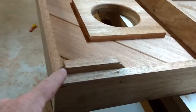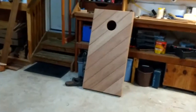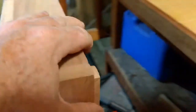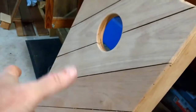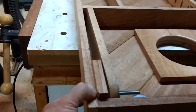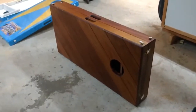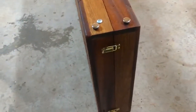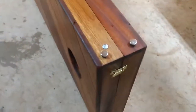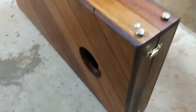I build my cornhole boards so that they nest into each other and can be buckled together and stored on edge. With these corner pieces — a couple on this end and then the same on the other cornhole board — when you nest these things you have to turn them 180 degrees to each other so those corners actually locate and positively fix the boards on top of each other so they can't slide around. These are nested together, buckled up with those light-duty buckle straps, and sitting on the feet.